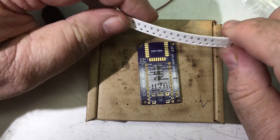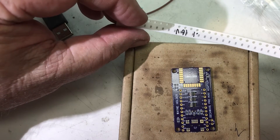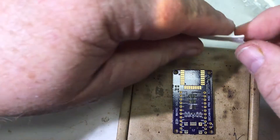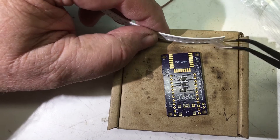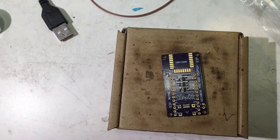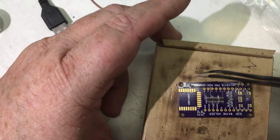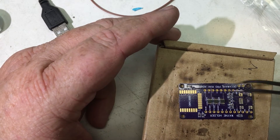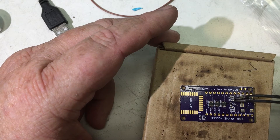Capacitors you have to be careful about because they're not marked in any way, so I mark the strip on the back. This is a 0.1 µF 16-volt capacitor that's going to go in two places. I just pull the strip back and let one fall out, and two fall out. There's no markings on them, so once you've dumped them out you can't tell one from another. So one goes right there, and another one goes right there.